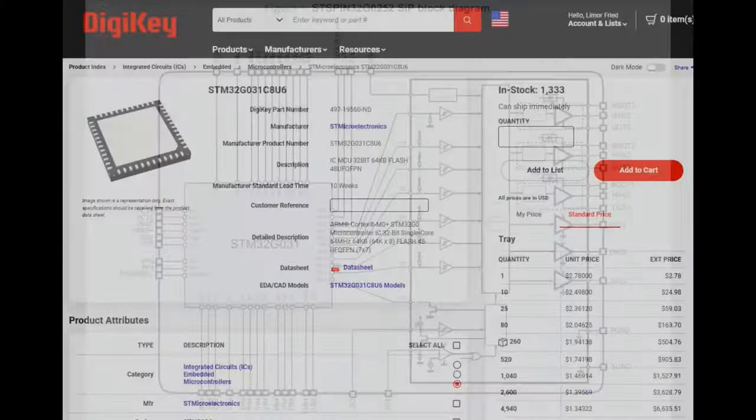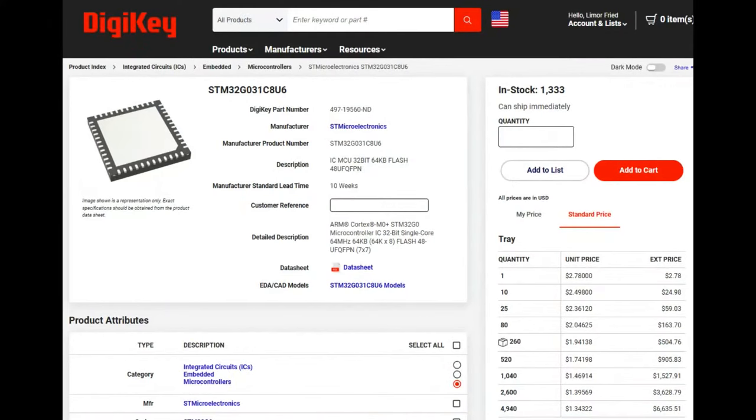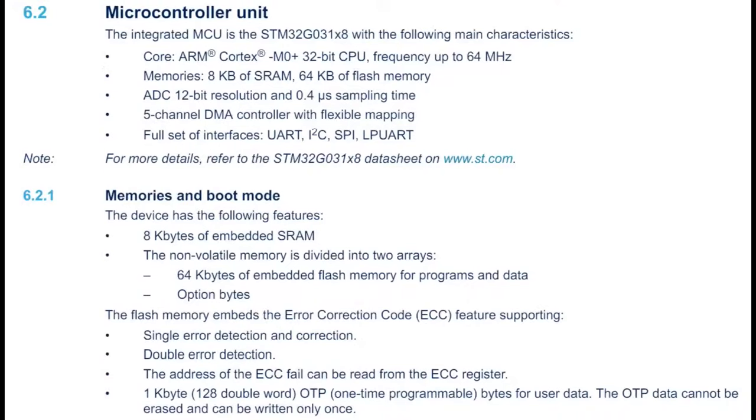So the chip is programmed basically identical to the STM32G0 you expect. It's exactly the same chip inside, which means you would use the same STM32Cube, the same SWD debugging, the same IDE, same program, everything's the same. And then you can use any of the peripherals. Obviously, they're going to pick a chip that has example code ready to go to control the brushless motor driver. So you could probably get started with their example code that's designed for this sub chip type.